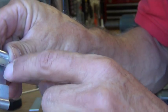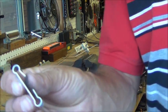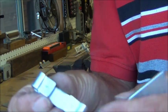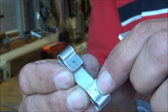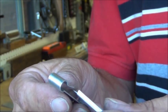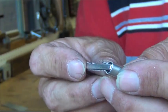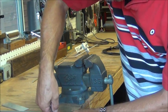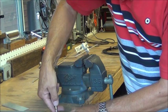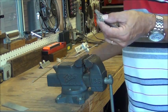What I'm going to end up doing is drilling a hole in both of these and putting a screw here. I may make another one and make it a little bit longer. I went ahead and made another one that's a little more evenly spaced. I put a couple dots on here where I'm going to drill holes for screws to act as a clamp. I'm going to put a piece of eighth inch metal in here so when I drill through it, it won't squeeze it flat. I'll center punch it where I'm going to drill, and I'm going to use 6-32 screws, so I've chosen a drill that's a little bit larger than that. Then I'll move over to the small drill press and drill the holes out.